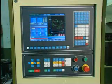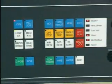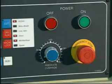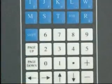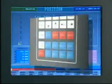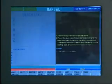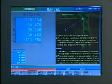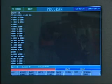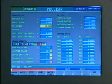The controls are fitted with a powerful industrial grade computer, easy to operate and with high speed. Also sophisticated features like edge find, center find, rotating, auto vertical travel and background edit functions. A multiple color screen displays graphics and simulates processing formulas. A zoom function checks even the tiniest graphic route. Cutting conditions may be set by picking up correct choices, which facilitates convenient operation.